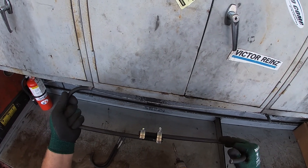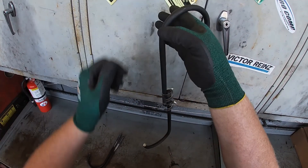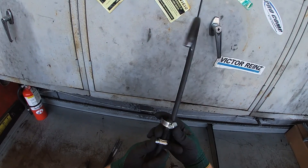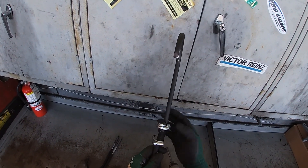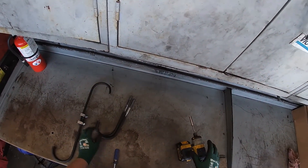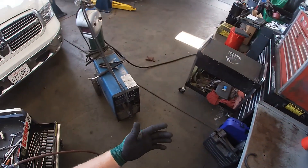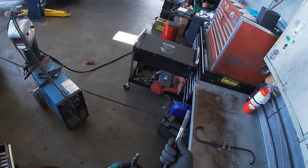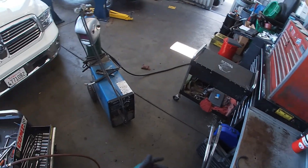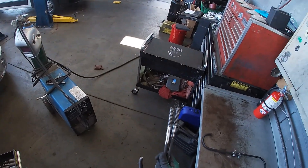The other nice thing is you can rotate them around, because you won't always have the ideal opportunity to hook onto a coil spring or another suspension component. Having them able to rotate is a benefit, so this is not a bad option at all. The next way is to weld the two together, which isn't a big deal. Any type of welder that can do steel will work — these are typically mild steel. We're just going to use a basic MIG welder to stick these two together.